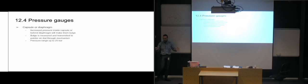And they usually don't have very large pressure ranges. They can handle fairly high pressures, but they can only handle a certain range, so you are locked to having, if you have an operating pressure of 150 bars, you can never have less than 125 bars, because it's not going to handle a larger range than that. It can just show you from 125 to 150. So it's not going to be able to show you if you get 80 bars in your system pressure. It's still going to show 125. It's not going to show you exactly how small a pressure you have. I imagine that's one of the reasons why they are less in use than the Bourdon tubes. The Bourdon tubes usually have a higher range that they can show.